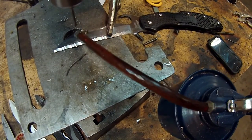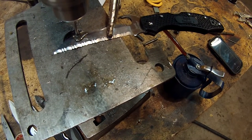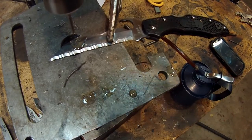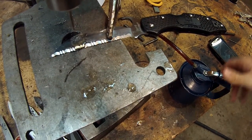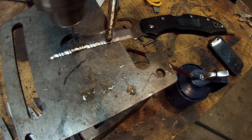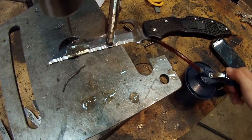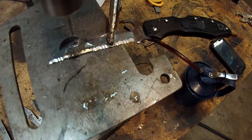We're already starting to get some filings. As long as you're using a drill press and not a hand drill — it needs to be in a straight, controlled force — use plenty of cutting fluid. These drill bits will cut through just about anything, and they make a nice hole. They don't bulldoze their way through it like a masonry bit does; they actually make a nice, proper machine-style hole, even on these super steels.